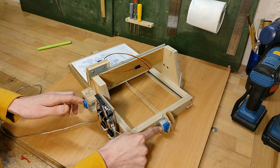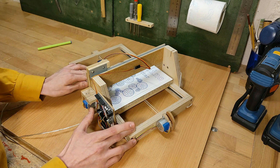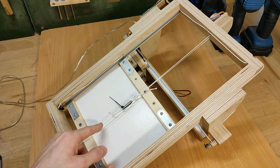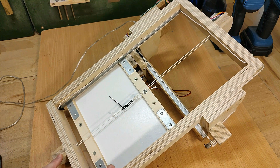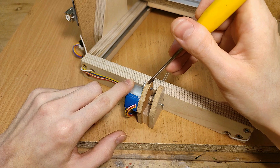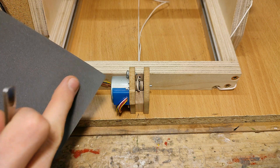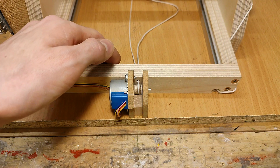The next advantage is obviously using these 28BYJ-48 stepper motors. These are ridiculously cheap and, in my opinion, well good enough for the job, even though a little slow. Related to the stepper motors, I'm not even using timing belts to move the axes back and forth — it's actually just some stiff string, which is clamped underneath a washer and runs over a pulley on the motor as well as an idler on the other side. To take some of the radial load from tensioning the belt off the motor, I added a little extension shaft to the pulley and extended the motor mount to take up the force. You might wonder: what if the string slips on the wooden pulley? Well, fear not — I forcefully lined the groove of the pulley with 800 grit sandpaper, which very effectively stops any slippage, up to the point that if it runs past the endstop into the wall, it just starts abrading the string. Guess how I know that.